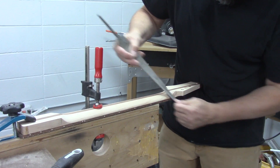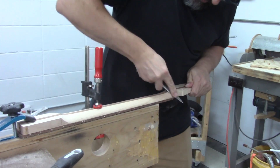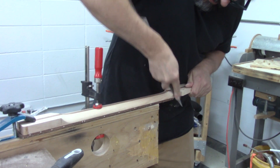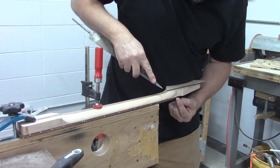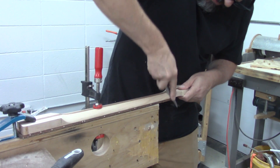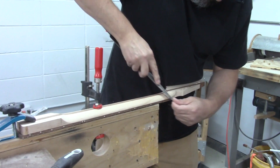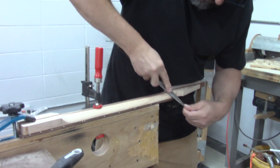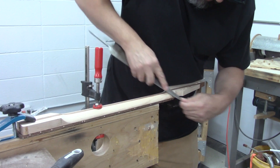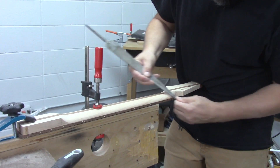The rasp is good to get started, but it is certainly possible to take off a lot of material with the rasp. The other thing that's tricky is you don't want the rasp to grab this edge here and take a chip out of your neck - that's a bummer. Use caution if you're using any tool upside down like this, because you want to be cognizant not to chip a place you can't see while you're working on the spot you can see.